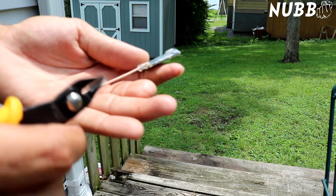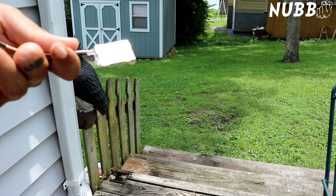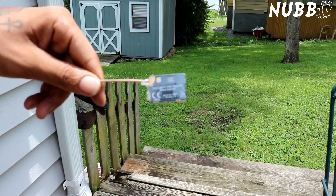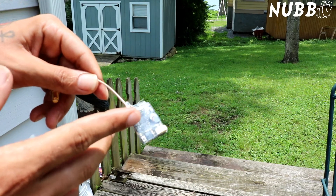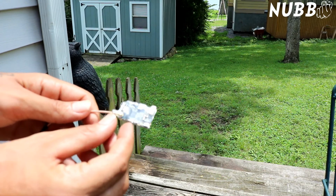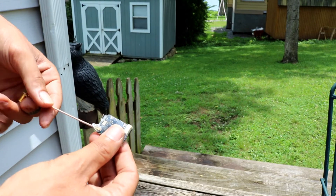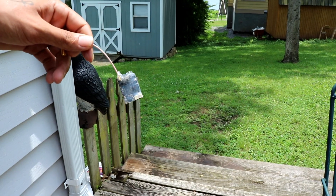Now with this VTX, you don't have much of a heat sink for it — he wanted to keep it as light as possible, which is probably why he goes with the thinner heat shrink around it out of the factory. So if you want to, you can always cut this heat shrink to about half and leave a little bit out for the open air. Or I've done it before where I just cut a small band to secure the U.FL. Thank you for watching — that's my three hacks for the TBS Unify.